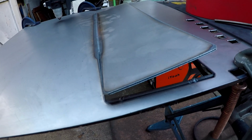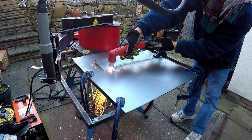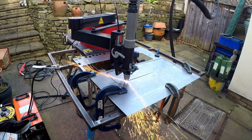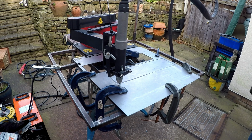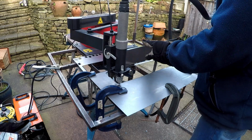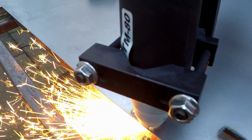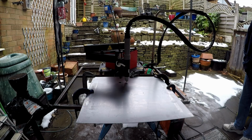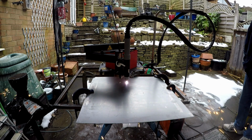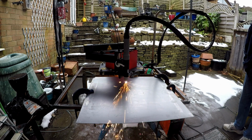I've never really cut steel this thin on the plasma cutter before, and as the centre part heated up it deformed downwards and the cut just failed completely. So I had to get the plasma torch out to clean it up. A second attempt with everything clamped down and plenty of support in the centre worked really well. I did a couple of test cuts for the XT60 holes just to make sure. Doing a couple of test cuts for the connectors up front was the best way to do it. It meant I didn't end up scrapping any large pieces of steel.